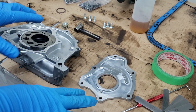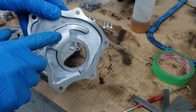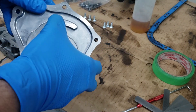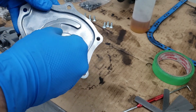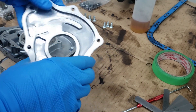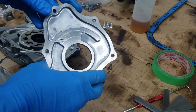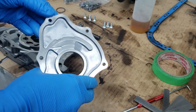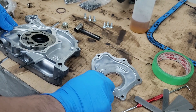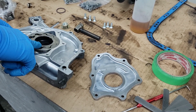As we opened up the oil pump, we also inspect these covers. As you can see, there's a little bit of scoring here, but it's something you cannot even feel, so that's pretty good. If you feel some deep gouges in this plating or case, it's probably a good idea to replace it, because the tolerances are probably not so good and it's getting excessive wear. Since this plate is still pretty good, we can start inspecting the inside.